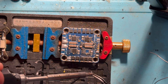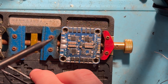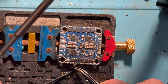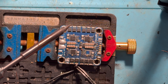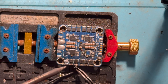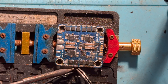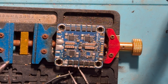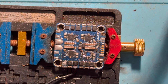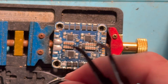Same thing with the motor wires — you're gonna want to make sure that you've got some solder on them. These already have a bit because this is a used motor. Grab the wire with your tweezers and align it to the side. This ESC actually has little grooves in the pads so that you can touch the wire right to the pad and embed the wire in the side. What that does is give it more surface area to actually stick to the pad. If you've ever crashed and ripped your motor wires apart and smoked an ESC, this is something good to check — it will help with durability.